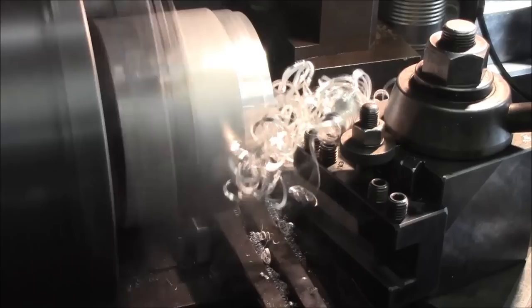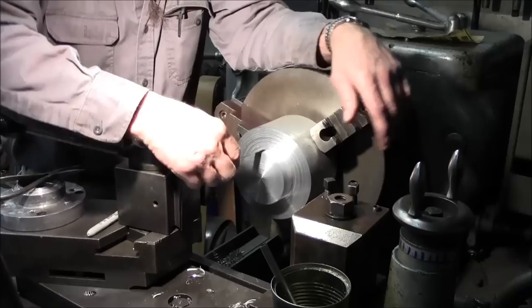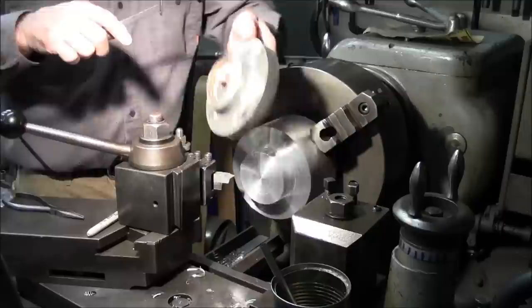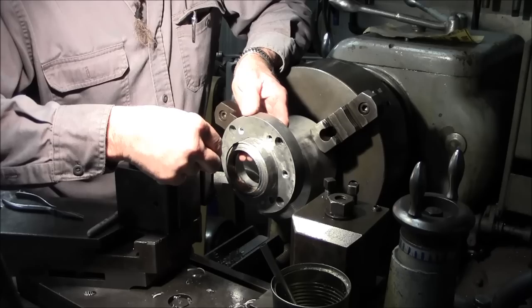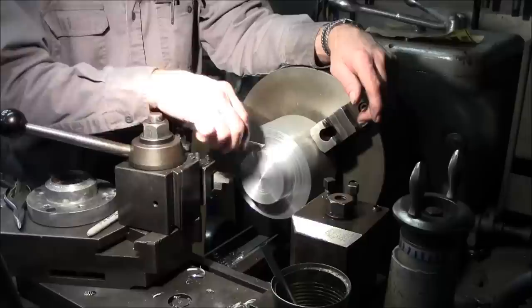All right, I'm coming in here. I just kissed there, so we're gonna be about 50 thousandths over our finished diameter there. And this is about 1 inch deep here. And of course, we've got a lot of chewed up stuff here to look at and play with, but I'm kinda going by about 1/100 as our depth there. So we're gonna go ahead and whittle this out probably 1 inch, 75 thousandths. And this is gonna be about 50. We're gonna get this just whittle clean.